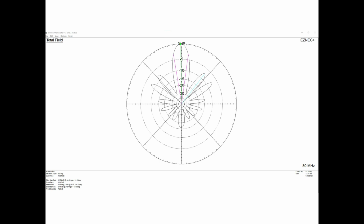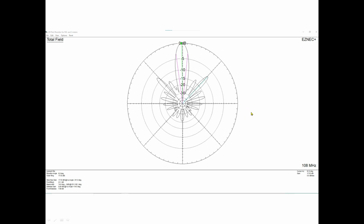the other thing you could think about is people used rhombics for TV reception, right? You had broadband 6 megahertz signals that you needed. You couldn't use a Yagi for this. You'd have to use a log periodic. But with a rhombic, you have very wide bandwidth and very stable SWR, and it was easy to match to the 300 ohm input. So that was one of the uses. But the FM broadcast band is a great use for this.